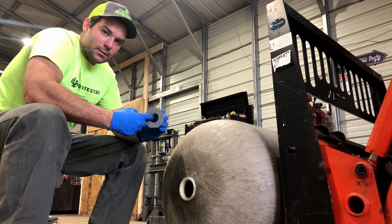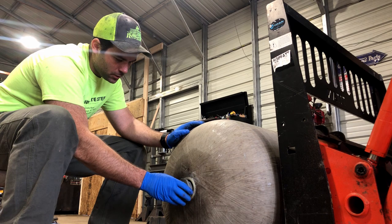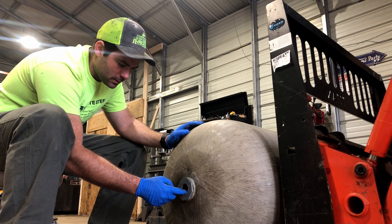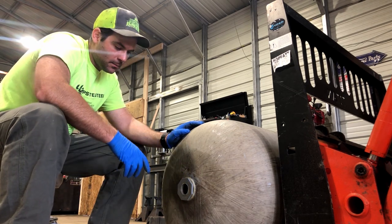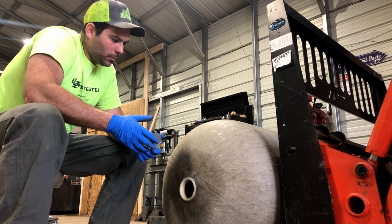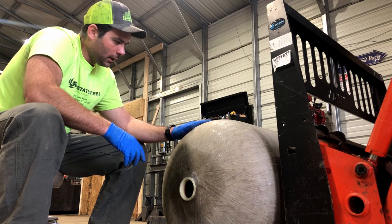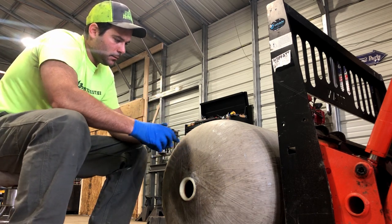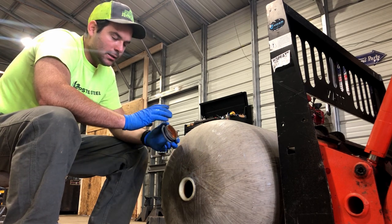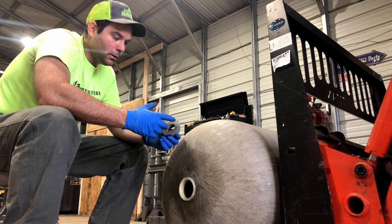My intention is I'm going to get some steel fittings to match this. You'll end up screwing this in here, and the metal rod you buy is going to be the diameter of this, so you can slide the pipe through on both sides. The pipe will be sticking out and then you'll end up welding right here along the pipe and this metal fitting. Then you come to the problem of needing somewhere to fill it up. I'll drill a hole somewhere up here that will be off the rolling edge, get another fitting, thread it in, and use JB Weld epoxy to bond the two plastics together. Then simply get a cap — that'll plug it up so you can put your garden hose in there, fill it up, and tighten the cap down.